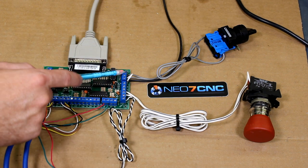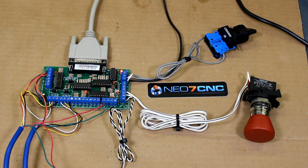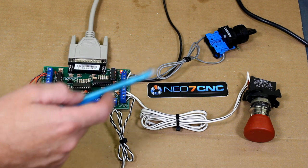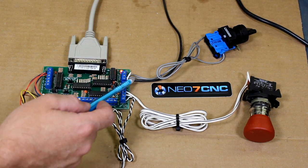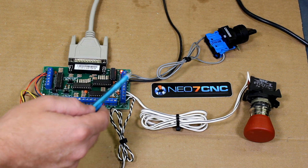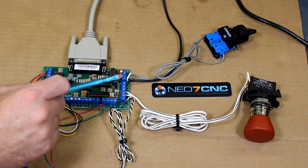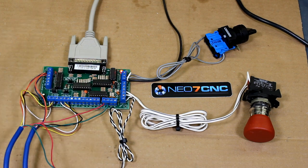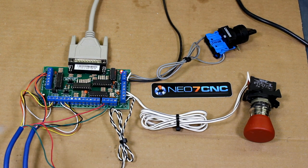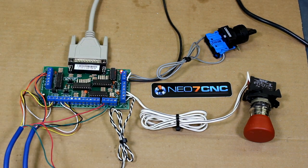Moving up, this is the power input for the C10 — it requires 5 volts DC. I'm using a repurposed wall wart power supply that outputs 5 volts. It has a coaxial cable so the black shield wire goes to ground and the white inner conductor goes to plus 5 volts. Two gray wires tie into the plus 5 and the enable pin. If that enable pin doesn't see 5 volts DC, nothing moves — no servos, no steppers. I have a normally open switch so when I toggle it on, it sends 5 volts and enables the C10 board.